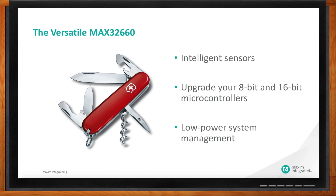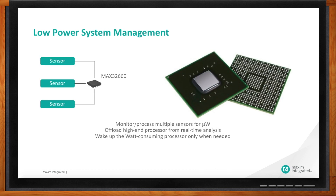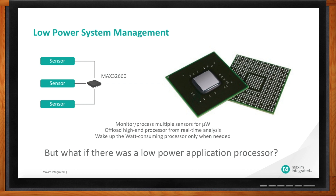Let's talk more about low power system architecture. When you've got a big processor doing beefy tasks — a microprocessor consuming watts of power, even getting pretty hot — you don't necessarily want that processor waking up to service a sensor, especially if one of those sensors is being used to figure out when to wake up the whole system. Think about a motion camera: you don't want the big processor waking up all the time monitoring the motion sensor. You'd rather have this low-power microcontroller monitoring all those sensor inputs and then saying, 'Hey big guy, it's time to wake up and do your work.'